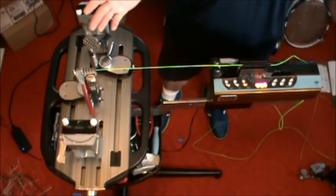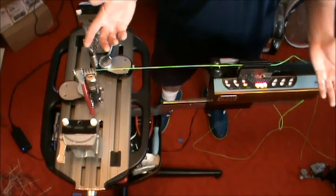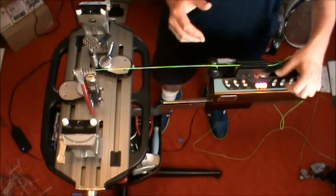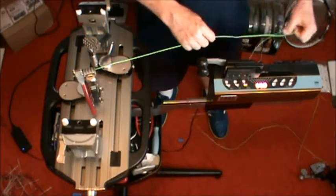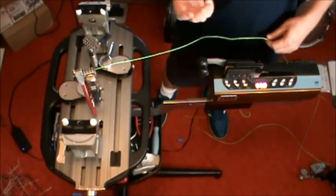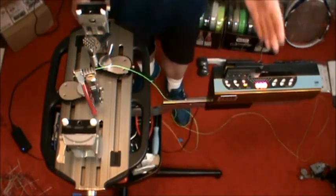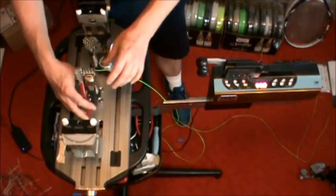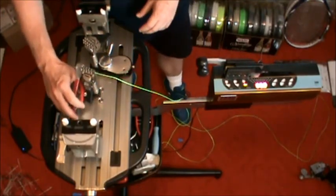So before I release tension, you can see that this polyester string that we had pulled at 55 pounds is now down to 44.6. So tension drops really quick on strings. That's one of the reasons why they created constant pull machines, is so that the string is still at 55 pounds by the time you're clamping it. So now I'm going to set it up with the actual calibrator.